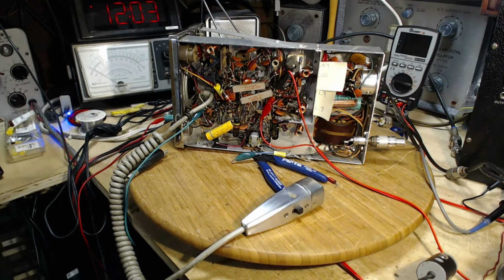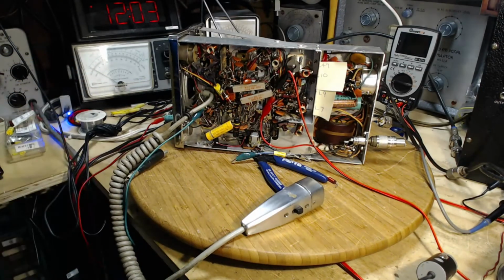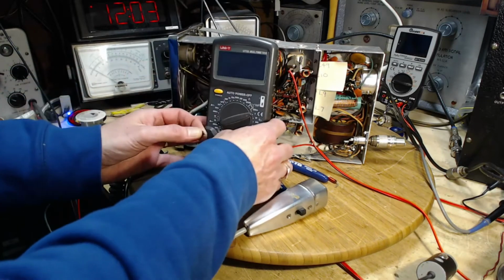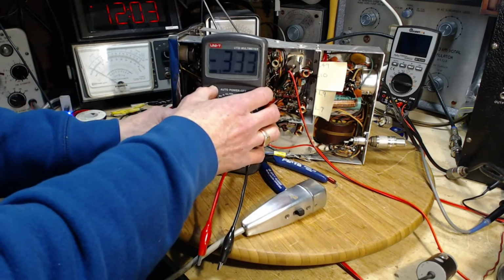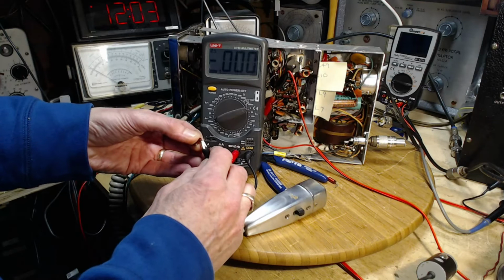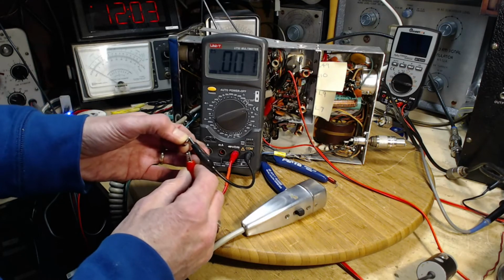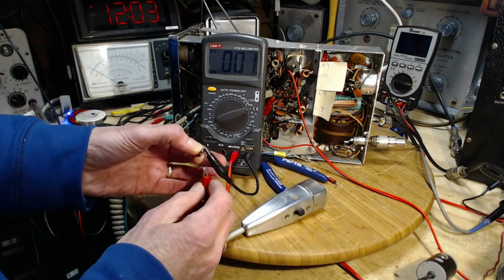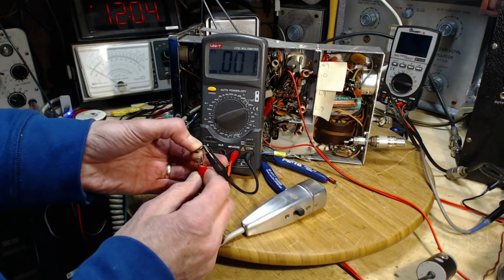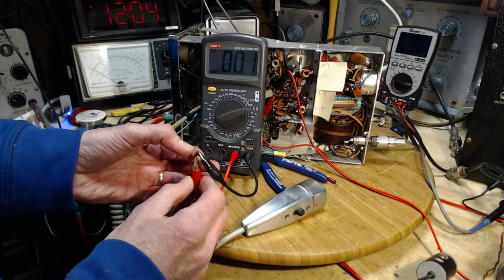And so what does that tell you about all those ceramic capacitors, if I've got an old ceramic laying around? So this is the ceramic I took out of it. What did you do with the voltmeter? Bring it back. I've only done this with basically paper and wax capacitors. I've never really done this on anything else. So on the voltmeter, there can't be much of a charge in here of any sort, so watch the meter carefully. It may just flick up and go to 0. Well, I don't know, do you call that a flick up and go to 0?